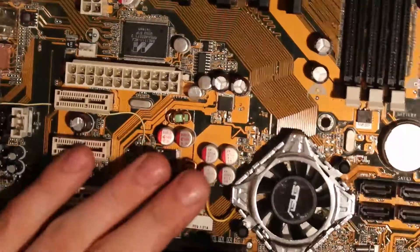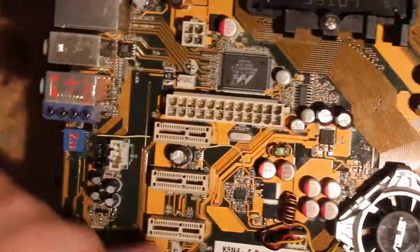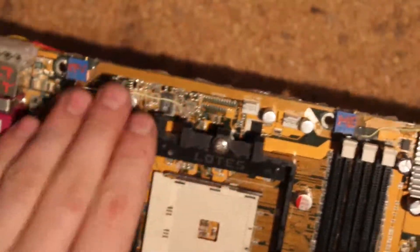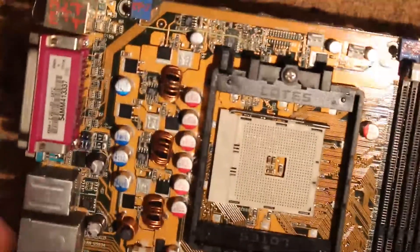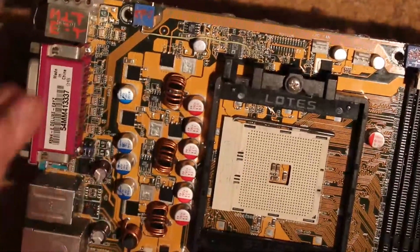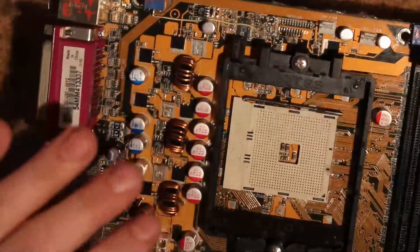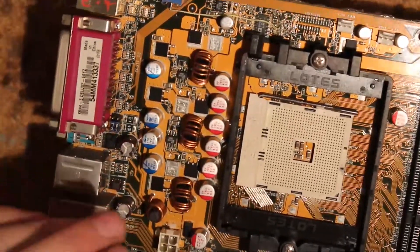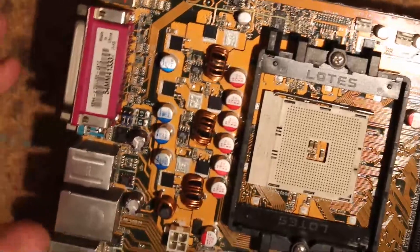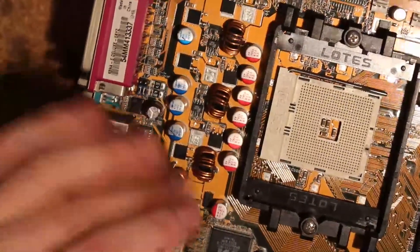Stock, the board for some reason doesn't have chipset voltage control so you need to do a feedback mod. All the feedback mods again in detail afterwards — which pins you need exactly. There's nothing super complicated here. I will also show the switching frequency mod on the computer for the CPU VRM. I raised the switching frequency to something around 320 kilohertz, which is still within the limits of what these FETs can do. Those FETs here are not particularly good. I would like to raise it further with changed inductors and FETs at some point because the controller here is pretty good, and I think it would also need replacing the input filtering inductor to something with higher current capability.